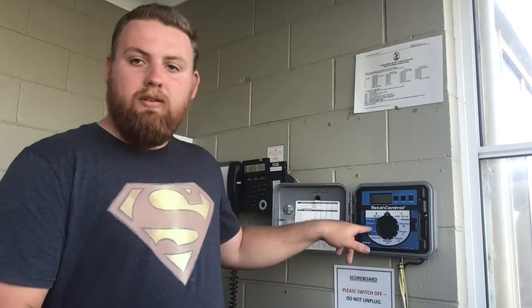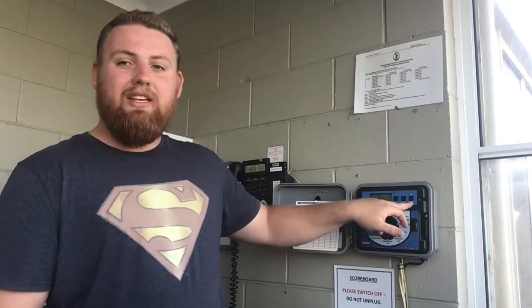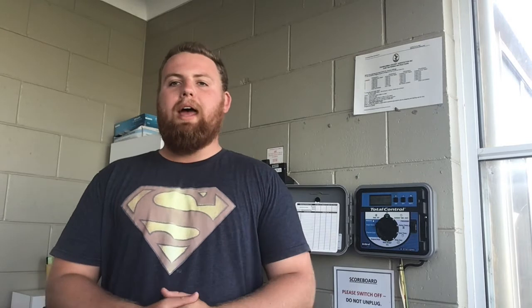If you're in the middle of a game or there is one particular dry patch on the field and you just want to water one area, there is a section here for single station mode. You use the next button to select which cannon — they're all numbered one through to six — find whichever cannon you want to use and click on, and it will just run until you click off. Again, there is a one minute delay on field two, so you want to make sure you finish your watering with at least a minute to go so it can run its way out on the field.